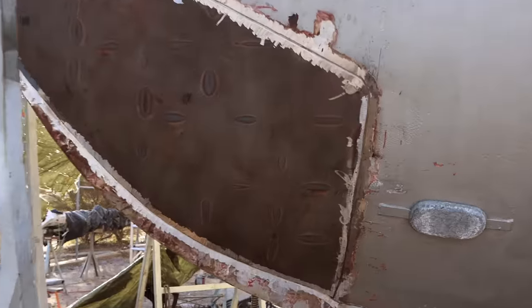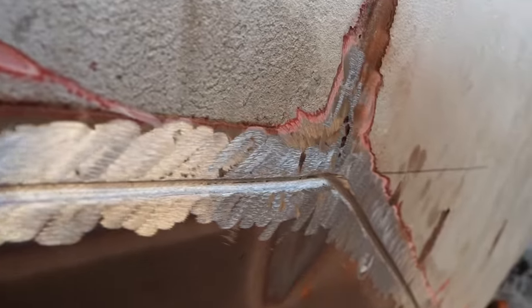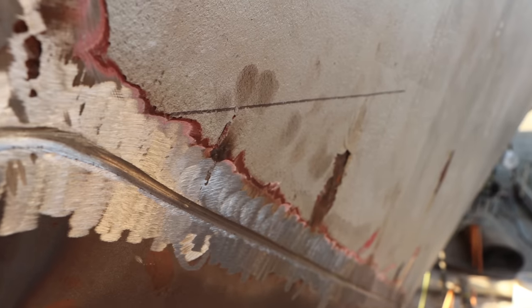Right, that is weld prepped. Let me show you. As you look along there, you can see it's basically V'd out, and there's no punctures through into the hull. As you come down, it's the same sort of deal all the way down. So that profile follows right the way around this plate. Right down the stem here, you can see that I've gone through, like this one here is a weld that I've cleaned off. I've basically rounded them back into themselves. Another one just there.